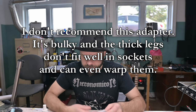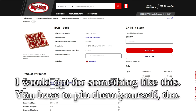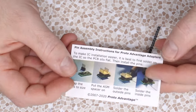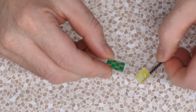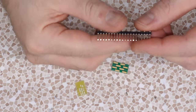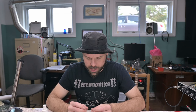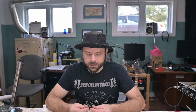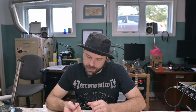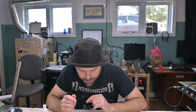Now what do we do with this guy? Well, I'm glad you asked. I got these kits here — got them from Digikey, part number straight up PA0001. This is a SOIC-to-DIP adapter. Comes with some very basic instructions on what looks like the back of a business card — that's smart of them. You gotta solder that chip onto here, add some pull pieces, and then it can be DIP compatible. It's for eight pins but they give you like 20 — are these easy to damage? Am I gonna find out why they give you extra?